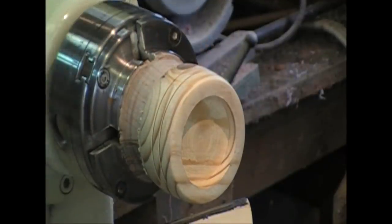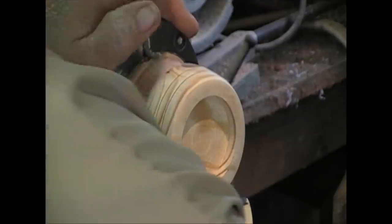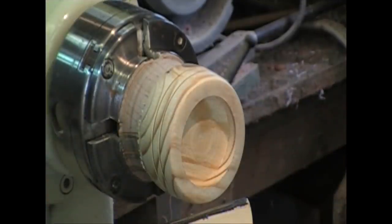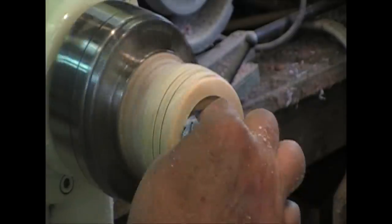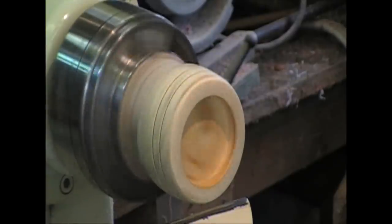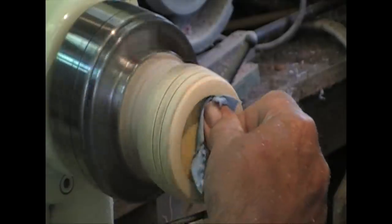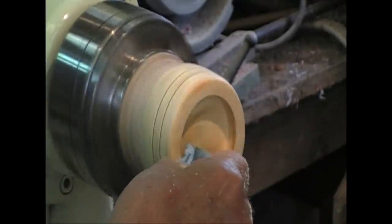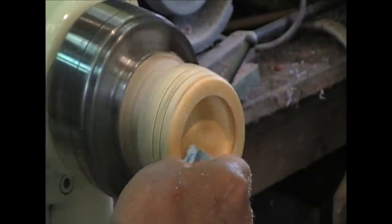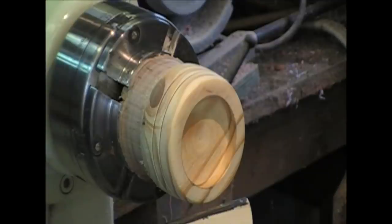Do I want to do that right now? Not really. Before I double-stick tape on this to change the chuck, I do want to seal this up. I'm going to do a little quick fix — I'm going to seal it up using CA glue. Bring my speed back down about 300–400 RPMs and I'm going to put the CA on it to seal this area off. That allows the tape to stick better. Now I'm not going to stick the tape on wet CA — that's dry by now. I'm going to put a little bit of it on and that's going to cure up this piece so I can get a little bit of head start on finishing also. Just dribbles of it. I got stuff stuck on my hands — you didn't tell me to put my gloves on. I'm working alone here.